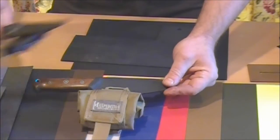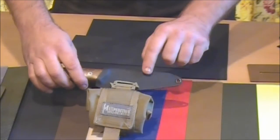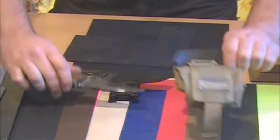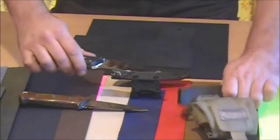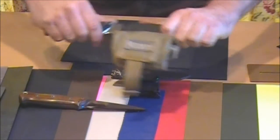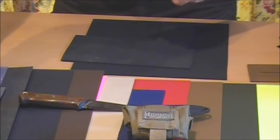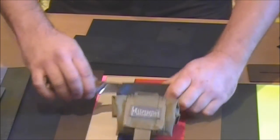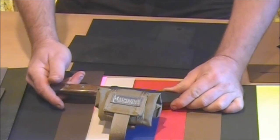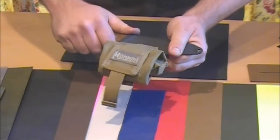This is the same knife as this one, but is a lighter weight, and this is a 60 thou sheath, and this is more than adequate for this one. Just say they're the same design knife, however they won't fit each other's sheaths. Each sheath is moulded to its individual knife, and especially with custom handmade stuff, you will never get two of the same mould to fit if they've been handmade. You can, with production knives, make one off and use the same knife as a pattern, but in general the sheath is moulded directly to the knife.